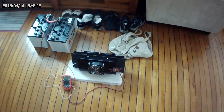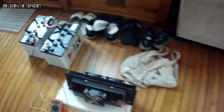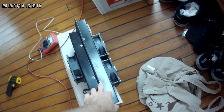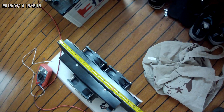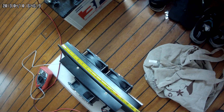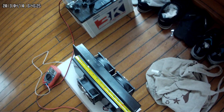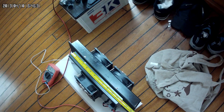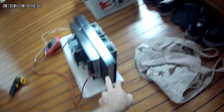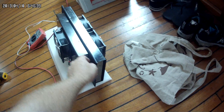Okay, here it is — the unit has arrived. This is the DC air conditioner with the Peltier theory. All the Peltier modules are in between this unit. The unit itself is 15 and a half inches on the hot side, and on the cold side it's 12 and three-quarter by 11 and three-quarter inches. It has large heat sinks.